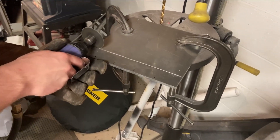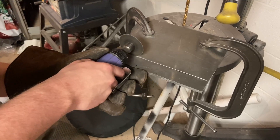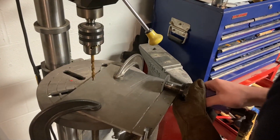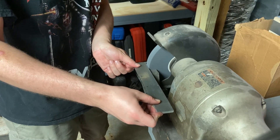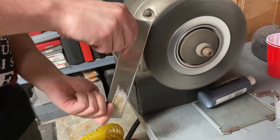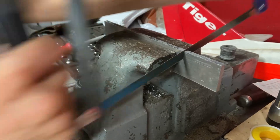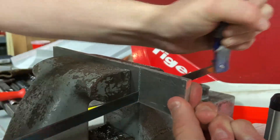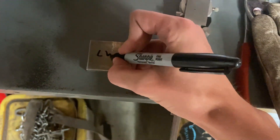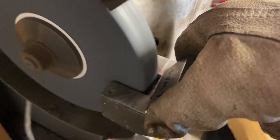I had some metal pieces that would work well for the LWA parts. I don't know what that acronym stands for, but essentially these are metal plates that are sandwiched between fiberglass layers between the wing and the wing spar, and they provide a surface to put a bolt through to bolt on the wing. Each wing is held on with three bolts. This process involved referring to the plans, marking the metal to the right size and just a little bit over so they could be filed down to the proper shape and size, cutting them out, and then adding the finish and polishing the edges. There was labeling them to make sure I wouldn't forget which ones were which — that's a distinct possibility in a lot of my projects, so I have to write a lot of things down.